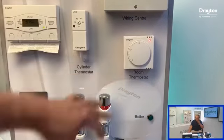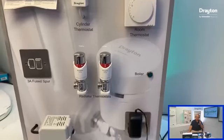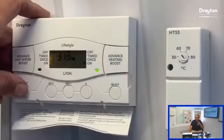So in this scenario, the customer will only get central heating as a function of the hot water being on. So we can set this up with, if we're calling only for central heating, remember that the valve needs time to travel over. It's only a couple of seconds, but you won't see an instant response like you would with the hot water side, which is directly connected to the boiler. So we'll give it a couple of seconds, and we see that the boiler never fires.